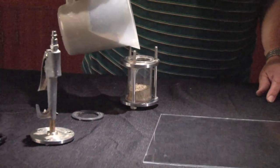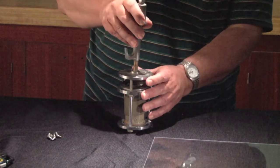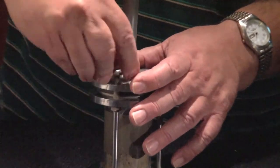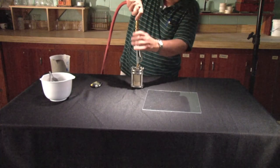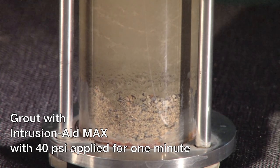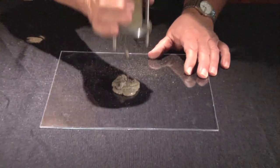Another consideration is the force applied by the grout's own weight all the way to the bottom of the pile. A test was developed at Specrete to simulate that pressure. A pressure of 40 psi is applied to each grout for one minute. Minimal water can be seen being pushed from the grout with IntrusionAid Max, and after one minute, the majority of the grout remains fluid.